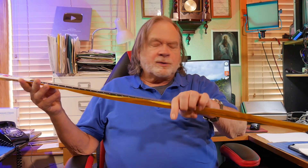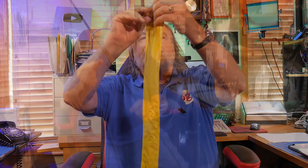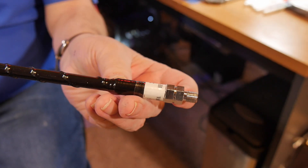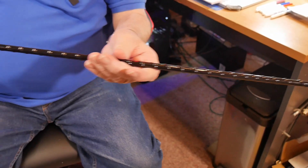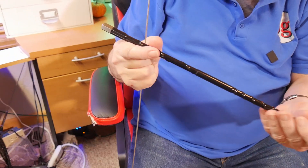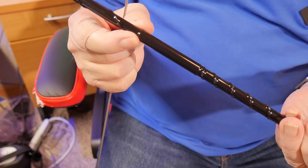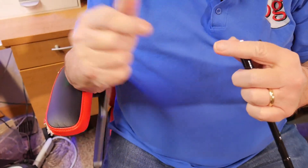What he's talking about is taking two of these — this is an MFJ 1620T for 20 meters, an HF Mobile Hamtenna that will go up to 250 watts. It's composed of two parts. First is the base. This end right here has threads that will go into that base. Here is the antenna itself, and right here you can see where this gentle twisting becomes a coil — this is the loading coil.